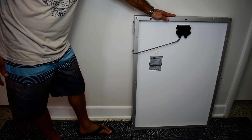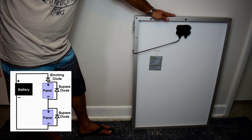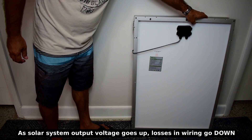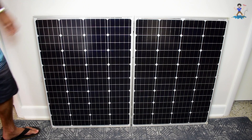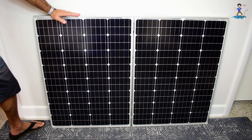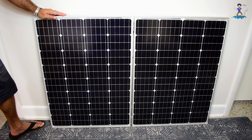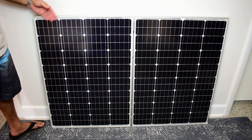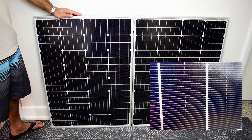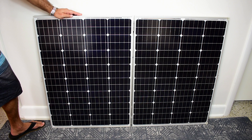I decided to wire my panels not in parallel to increase current, but in series to increase voltage to charge my portable sine wave power supply units. The output open circuit voltage for each panel is right around 19 volts. You have four across the top, eight down, 32 solar cells, and the voltage of each cell is just under 0.6 volts. I prefer a monocrystalline panel because they have very high power output and excellent power output under lower light conditions, unlike polycrystalline panels.